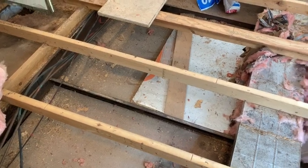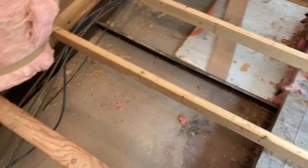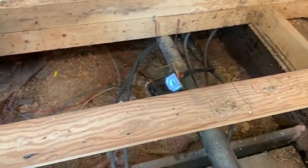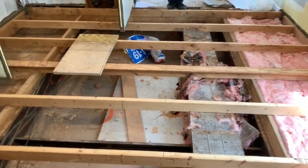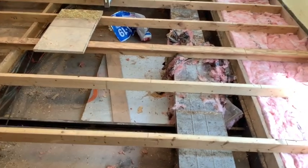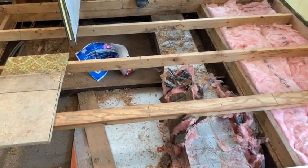And a lot of people think that this insulation is supposed to hang off the bottom of these floor joists. That is not actually the case. You want R19 in the floor, and if you can't put R19 on 3.5 inches, it actually laid down there at the bottom, just like we took it out. That's insulated floor, and that's the insulation that lays down there and inside there. So you don't have to get it up under your floor joists. There's actually no way to do that unless you run a string line or something underneath this whole thing to keep it up. But then again, you got R19, which is six inches of insulation and a 3.5 inch floor joist. So you cannot put floor insulation 6 inch in between 3.5 inches. It has to breathe.